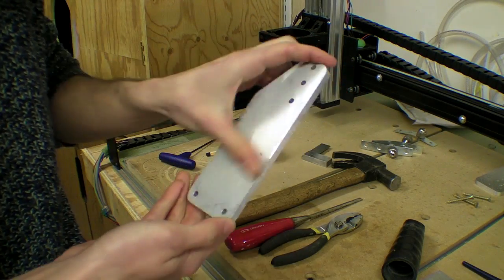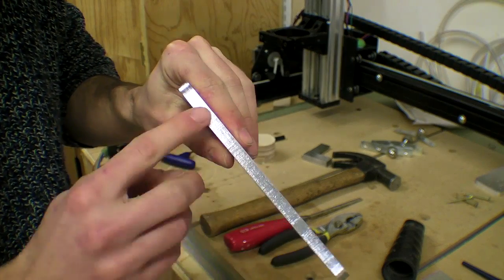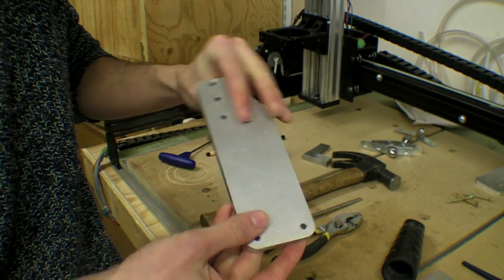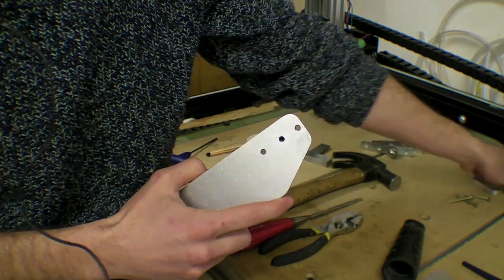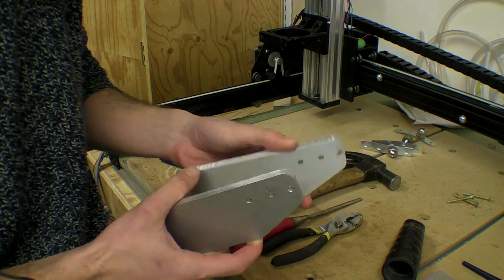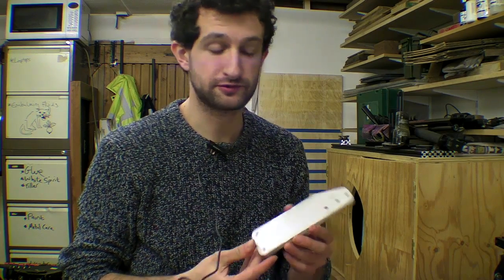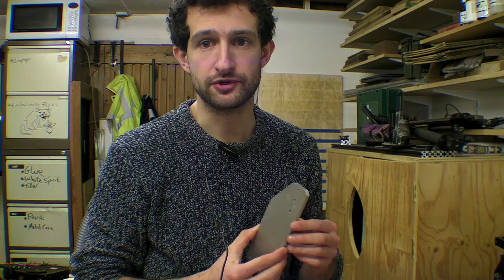This is the one that I cut out on the machine — it looks pretty good, the finish is pretty nice. The height is correct but the width is a mil short, so I don't know why that's happened — maybe the belt has become a little bit slack since I've not been using it as much. In retrospect I should have maybe used thinner aluminium and just laminated it together. It's cheaper to work with 3mm, it produces less heat when cutting, it's easier to cut — trying to go for 8mm in one go is a bit ambitious.